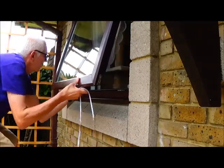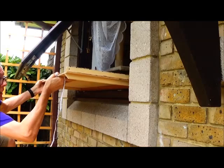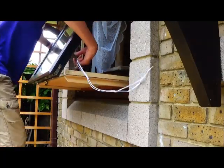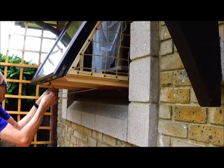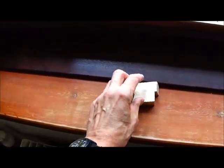Open the window, put the handle down so that the board rests on the ledge there. Then I can tie that over the hook and that around the handle. Finally, just to prevent the sides from dropping down in a wind or vibration or anything like that, there are a couple of wedges I've made - just off-cuts from the one-by-one - and they go in place to hold it firmly against the window frame.